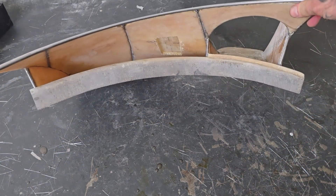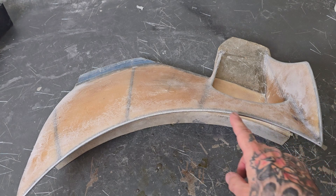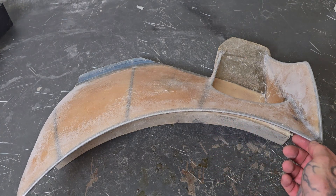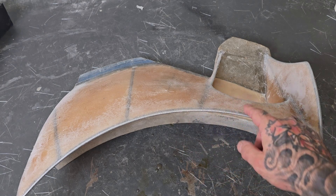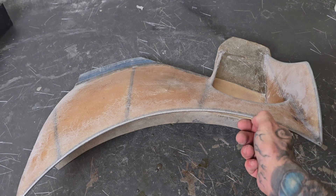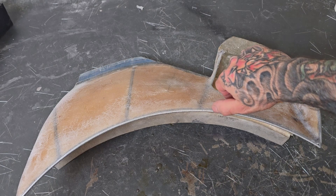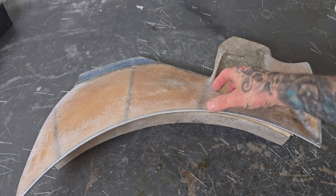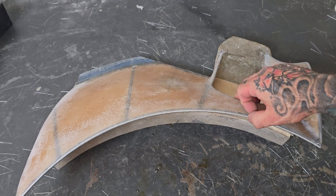Now I have not laid up the inside yet, and I did that purposely so I could illustrate this point. And if you look right here on this edge, you can see I have feathered this fiberglass back down to this round rod. Now I can take my fingernail and there's nowhere that I can catch. This has been really feathered back to the point where you can see this transition line between glass and metal.